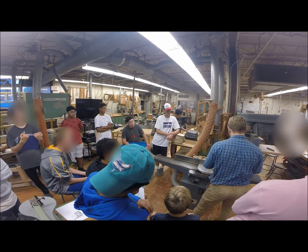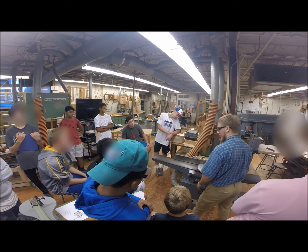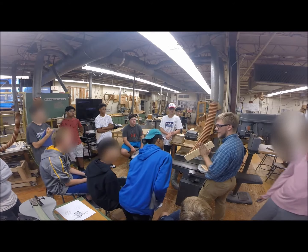So what I'm going to do — I've got my workpiece set up. I've got my push stick ready because my fingers will probably go underneath the guard. Let it spin up to speed. Left hand — press it against the fence. Right hand to push. Now I have a clean edge that's 90 degrees to my face.